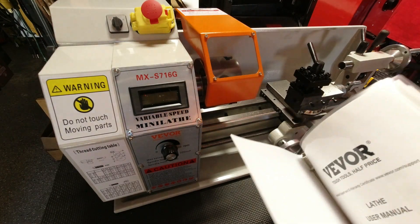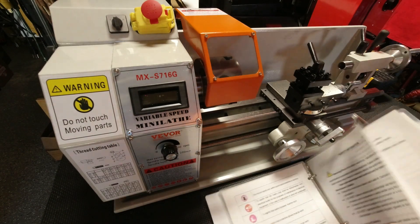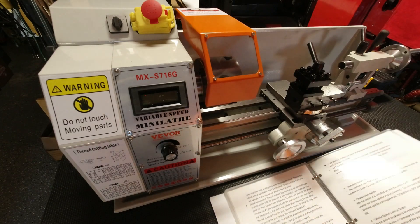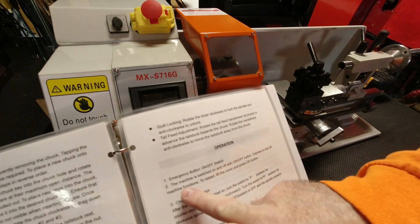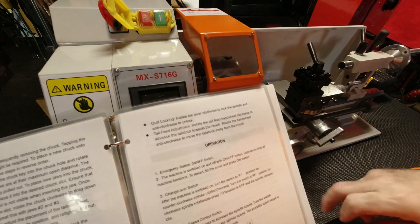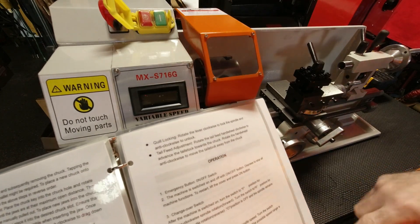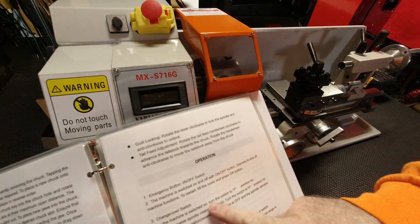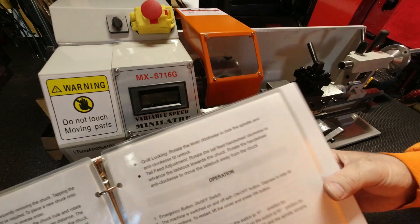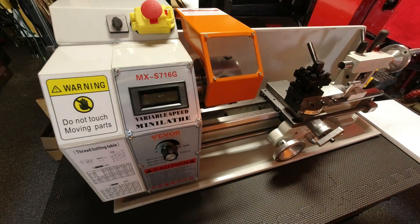So this manual is the exact same as the small paper, only these are laminated so the oil won't get all over them. I'll read you the operating instructions: the machine is switched on and off with the on/off button — that's the green and red. To start, lift the cover and press the on button. So I've lifted the cover and pressed the on button. After the machine is switched on, turn the changeover switch to F for forward counterclockwise spindle rotation, or turn it to R for reverse. We're all the way at zero with the spindle speed.